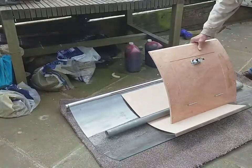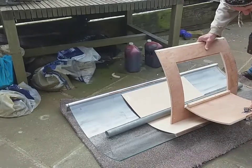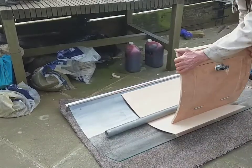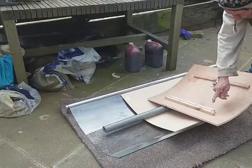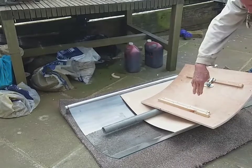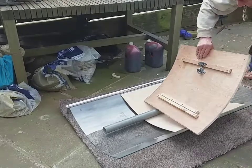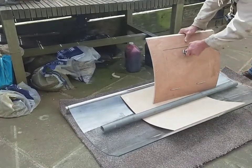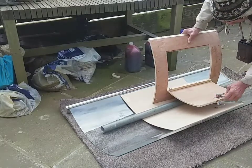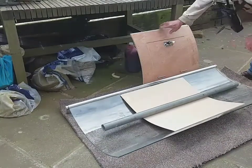This is a garage door handle that I've turned into a boot handle by making bits that fit on it. When you put your hinges on, I've glued and screwed a couple of pieces of wood here. Because this is curved, you need to angle it slightly so the screws don't hit. I've had to make this piece and put an M6 bolt in it to hold it so it locks and closes.